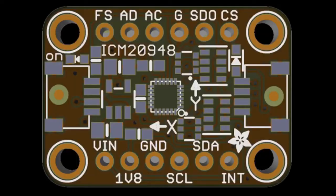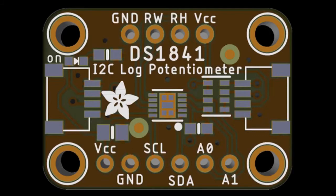And then an update, so we did the ICM-20649, which is a great 6DoF sensor. The next step up is the ICM-20948, which is a 9DoF sensor, and also has some built-in automatic orientation calculation capabilities. It's a magnetometer and IMU in one case. And so we're kind of slowly working our way around this chip. It's not an easy chip to use, but hopefully we'll have the Arduino code and CircuitPython code for this chip soon.